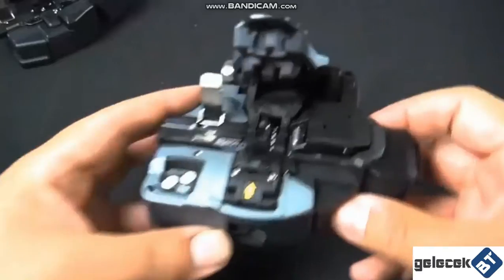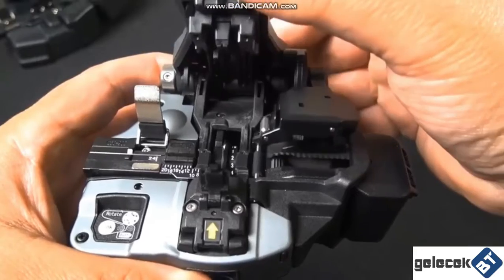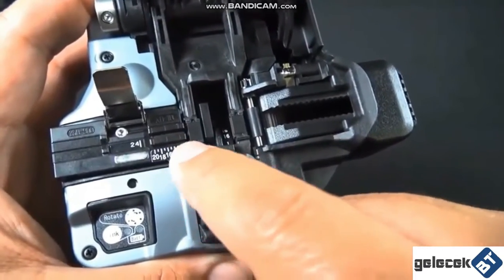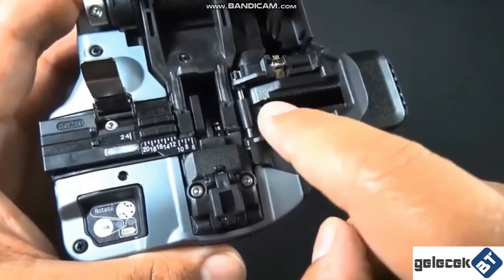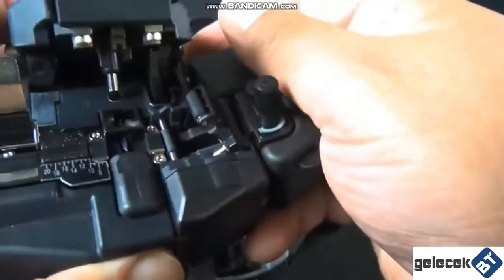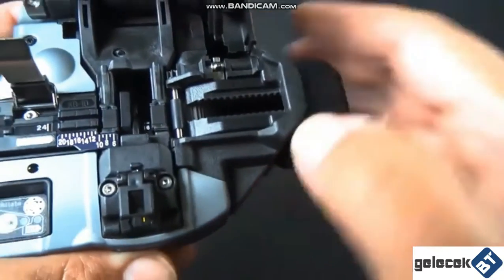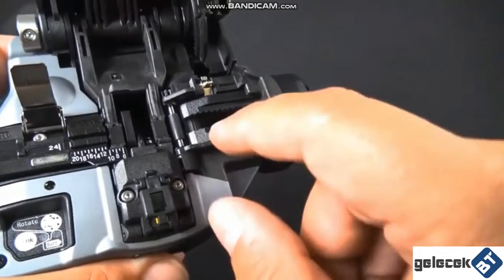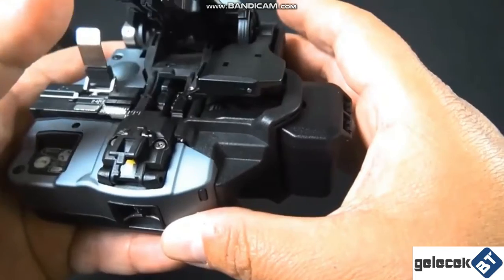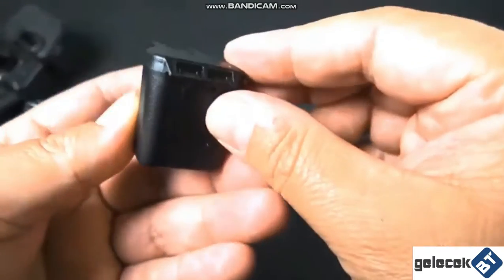Now with the CT-50, the new one — when you prep the blade in place, the roller gets picked up along with it. Now you have a lot of room there for your extra glass when you measure it and put it to the appropriate mark; you have that extra room to go into the scrap collector. That's a small detail, but when doing this out in the field, the CT-50's large area makes it really nice. You want to cleave a nice long piece, and it's nice to have that long piece just dump in there — it'll make a big difference if you do a lot of fibers.